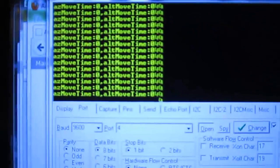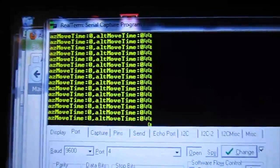1833 hours, and I've had a weird problem. I'm trying to implement the up and down. Let me restart the Arduino here, and we'll boot this guy up. Now you can see it's flashing and reporting data. This is the amount of time moves. When I send the command to move up, let me explain a little bit. I issue an amount of time to move, and then subtract that time from it until you get to 0, and then stop moving. So it's a time-based moving system.